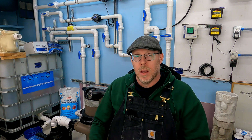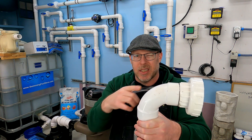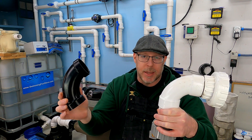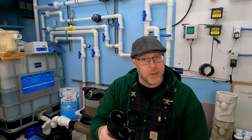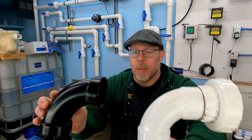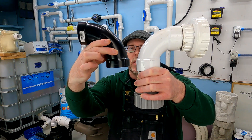I'm going to show you something important. I have a 90-degree fitting here — one is white, one is black. That makes it easy to tell them apart. But you have to be careful, because a lot of manufacturers these days are making the non-pressure-rated ones in white as well. So if you're at the store and you just see a 90, it looks like the right thing, it's white — it might not be pressure rated.